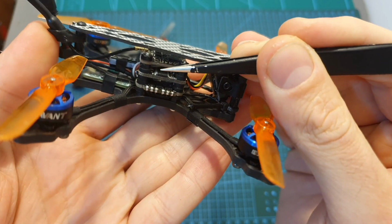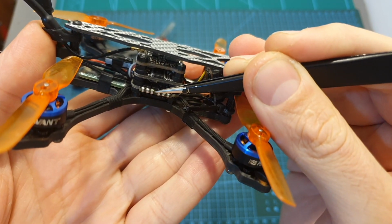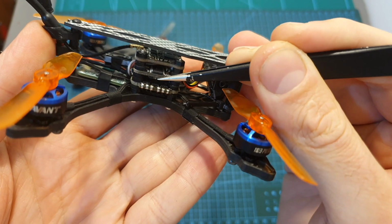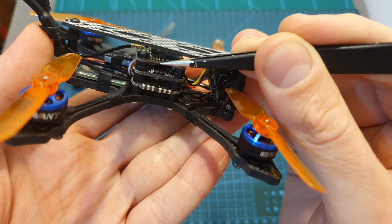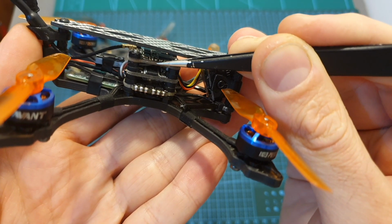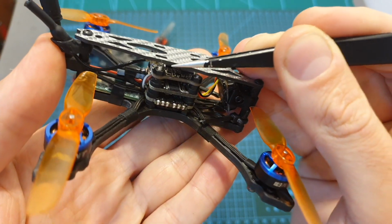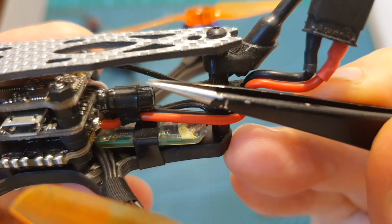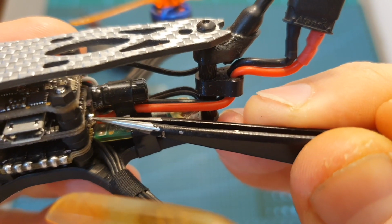The 16x16mm stack in the center of the quadcopter is based on a 13A 4-in-1 BLHeli_S ESC, an F4 flight controller which came pre-flashed with Betaflight 4.0.6, and a 48 channels VTX that has a selectable output power of 25, 100, 200mW, uses an IPEX antenna connector, and supports IRC Tramp protocol. A 16V 100 microfarad capacitor is pre-soldered to the battery pads.